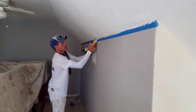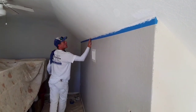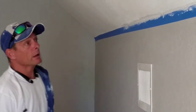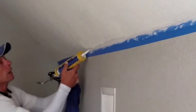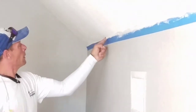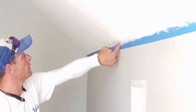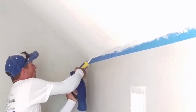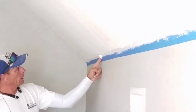Keep a wet rag with you. I've got a little extra on my finger. Come back that way. I want to make sure that's nice and clean. It takes a sec to do it, but it saves a pile of time trying to cut in a hand line on something like this. I'm going to come from this corner and bring it out. We never work into corners — we always work out of corners. That way we don't get too much buildup. Smear it in there.